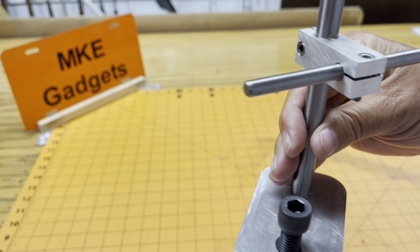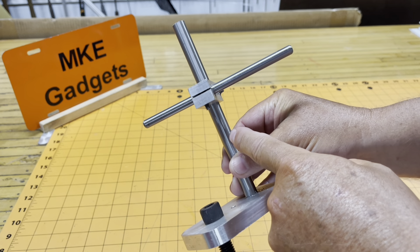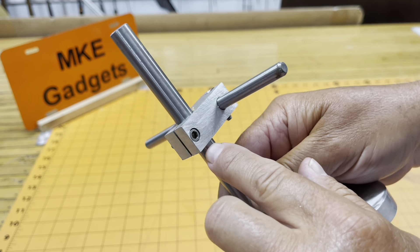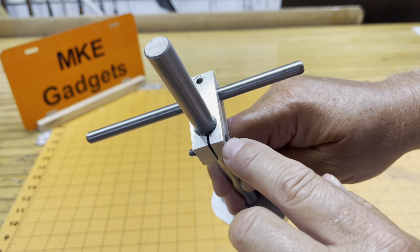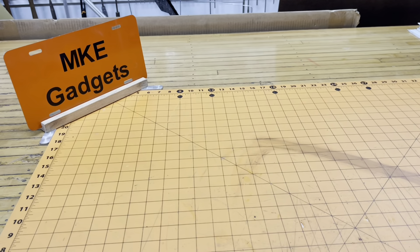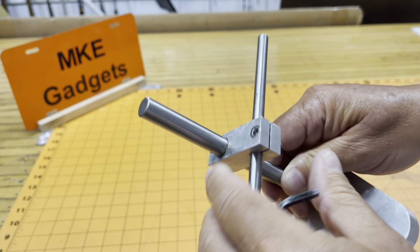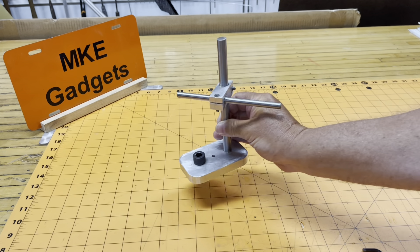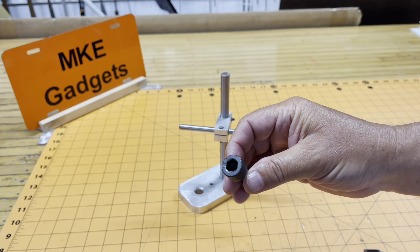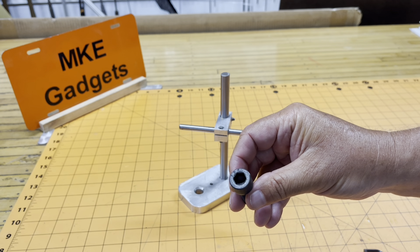Let's take a closer look. This is just aluminum plate, half inch thick, with two pieces of round tool steel — half inch diameter and five-sixteenths diameter. This piece here is three-quarter inch square with a slit for binding, and two small cap screws. Chips really get packed in there, which is annoying because you've got to clean it up before use — the whole thing gets oily and full of chips. So I want to make it so only one wrench works. The first thing I want to do is somehow modify this cap screw so I can have enough leverage to tighten it by hand, and once it's all set, go in with the Allen wrench.